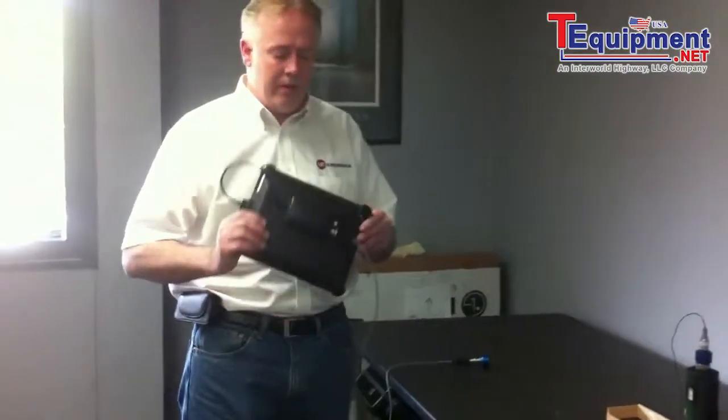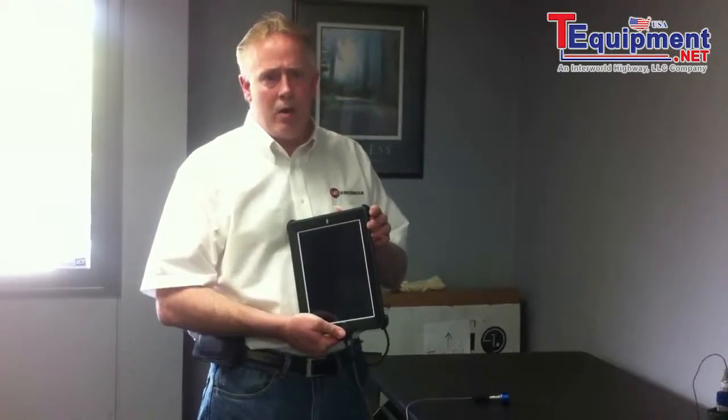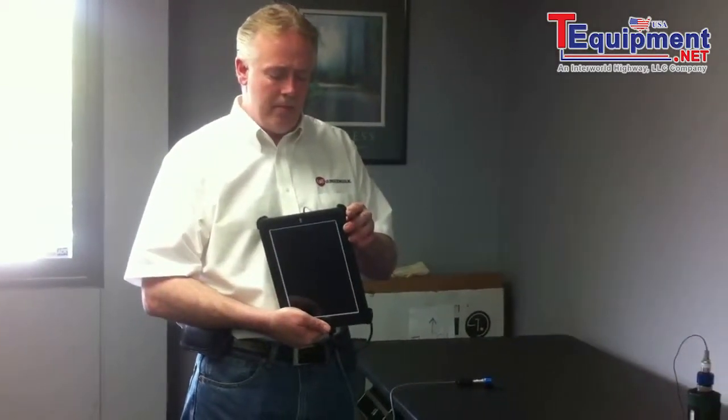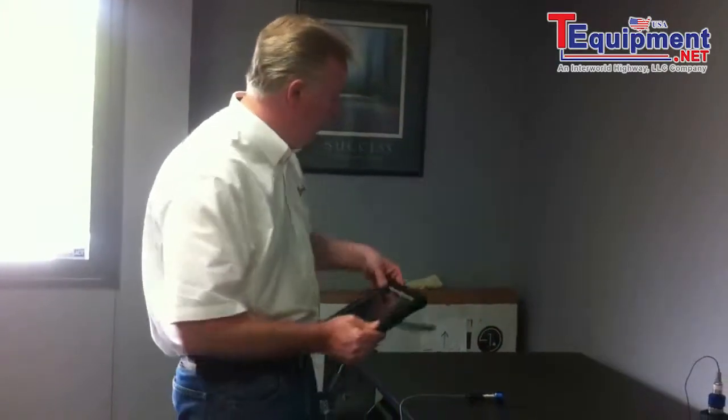As you have probably seen in many of our other videos, we've developed a full vibration analysis and balancing hardware kit for the iPad, which there are several other videos on the web. This is a two-channel device in a very ruggedized case made for route. We have two apps — one that does the vibration analysis and the other that does the trending for full asset route analysis.